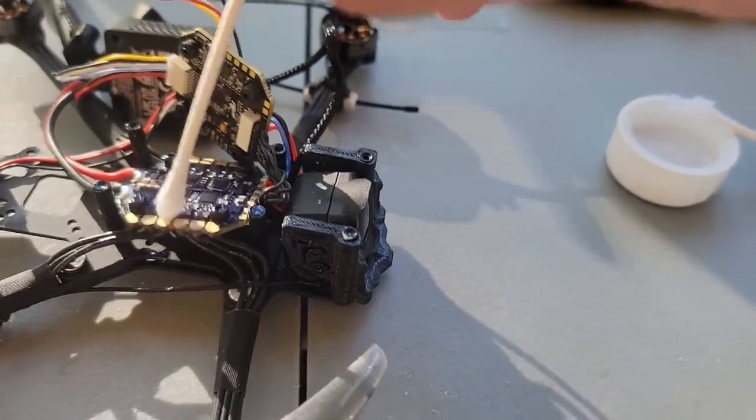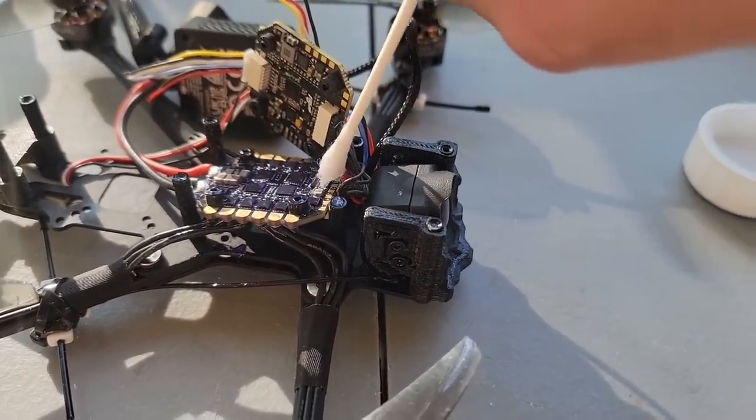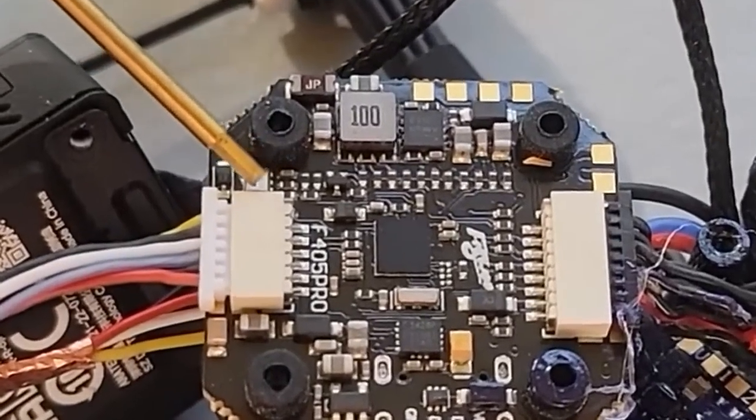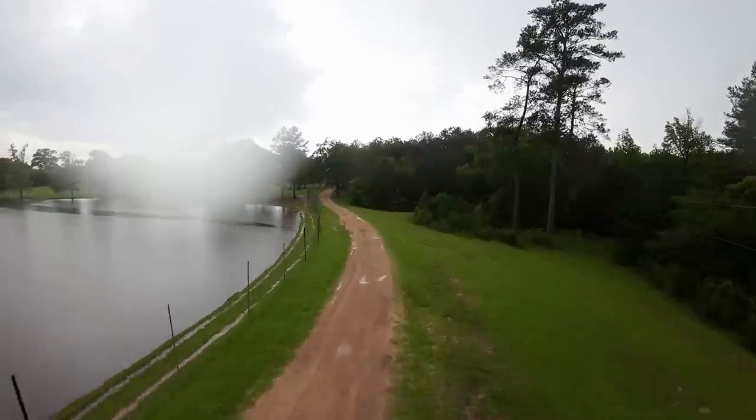While the drone is disassembled, let's take the opportunity and conformal coat all the electronics — except the O3 air unit, because I've never waterproofed it before; if you have experience, leave it in the comments. The Amazon affiliate link to the correct conformal coating is in the description — not this acrylic one, it's not as good. Be careful with this substance because it's a pretty nasty chemical. Do not reuse these swabs. The goal is not to make your drone fully waterproof but to come close to that. Avoid buttons, plugs, and the barometer — the barometer is usually a shiny metal thing with a very tiny hole in it. I think conformal coating increases the reliability of your drone; it helps against moisture, grass juice, fire ants, and whatever else you fly through or land into. Especially this little long-range drone, which is supposed to fly in the mountains with snow and fog.